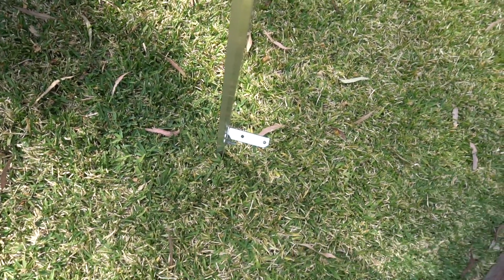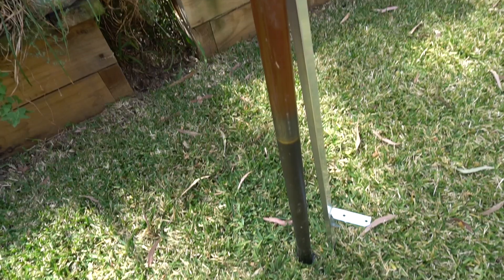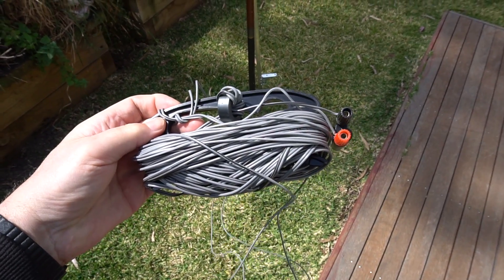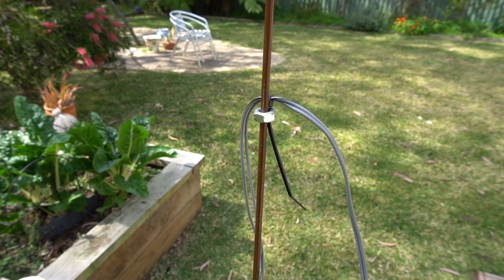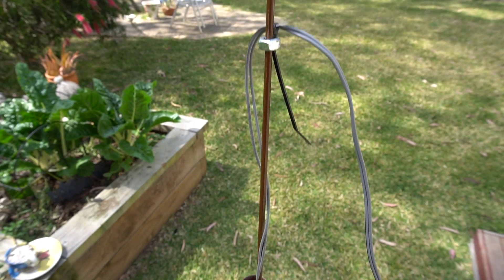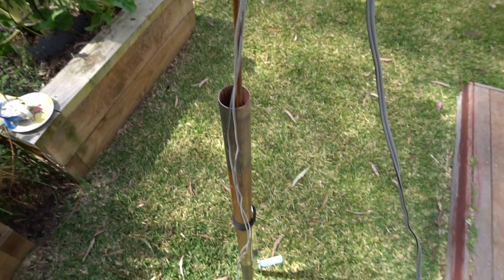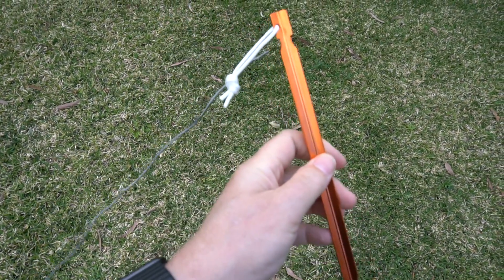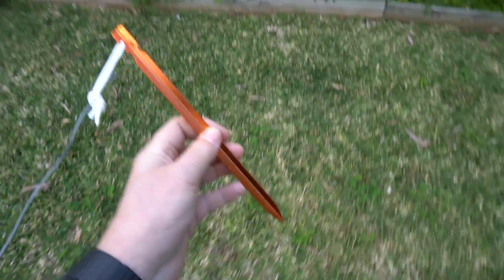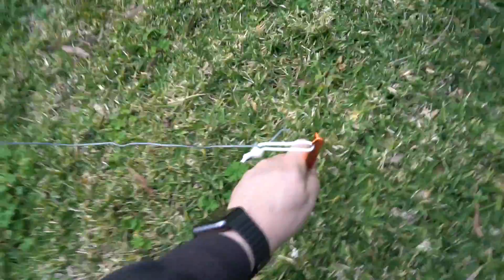A 6-metre squid pole is attached to the ground stake using double-sided Velcro. The wire is simple figure-eight speaker cable. A nut slides over the top of the squid pole, and the place where the feed line splits is attached via the tail of a cable tie. The inverted-L legs are held out with tent pegs. If I had more space I'd use some paracord at the ends to get the wire higher off the ground.